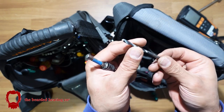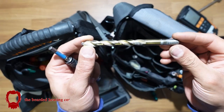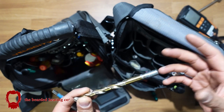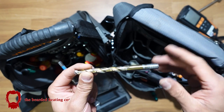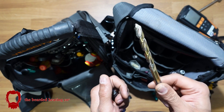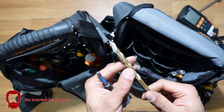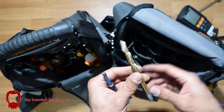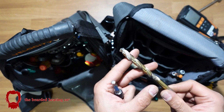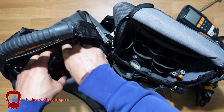A 4 mil drill bit just for drilling something — I always keep that in the bag. Also on the side I keep a 10 mil HSS drill bit, because here in Amsterdam or in Holland, 95% of the boilers are twin flue systems. Because they are twin flue systems, I can actually physically drill into the flue pipe to do a gas analysis, which is fantastic. Not all boilers have a test point — only the newer ones. The older Intergas HR version didn't actually have a dedicated test point so you can drill into that to do a test analysis. I love that, so that stays up here.